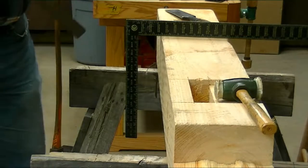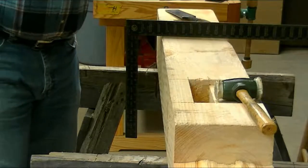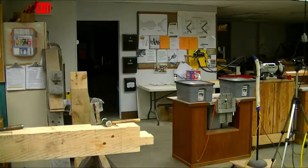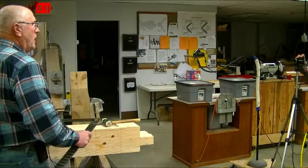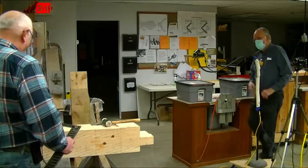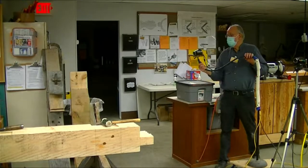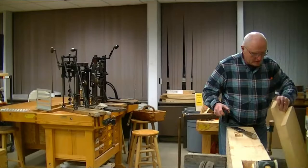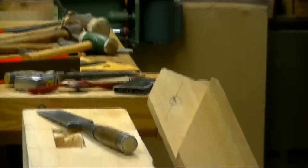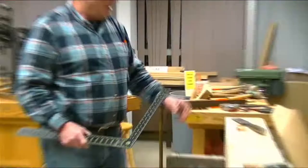These are framing squares. It's a two-inch mortise — I can strike the mortise using the two-inch dimension. Though it's a modern tool, it's been around for a very long time. Down one side of this square is a series of numbers; very few people know what they mean. These are actually used for your braces. Over here I have a brace that I've made — it's a mortise and tenon with tenons on the end. This brace is a 30-inch brace. If I look at my square and it says 30-30, right here it says 42 inches and 43-hundredths, which is actually the hypotenuse of a right triangle representing the 30 inches.